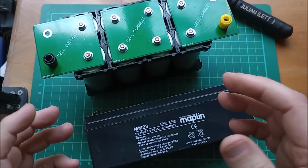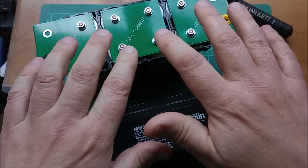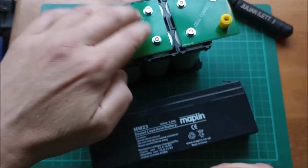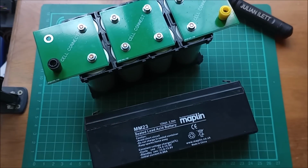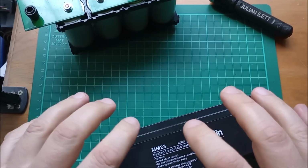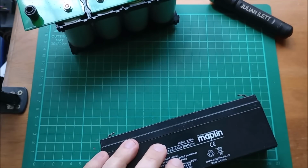The other thing, of course, is that if I want to completely charge this battery, its voltage will come up, the voltage of the source battery will go down, and there'll come a point where this one simply isn't more volts than this one. No, simply connecting them together is not going to serve the purpose. So what I need is some sort of engine, some sort of motor that I can pull energy out of one battery and push it into the other one.